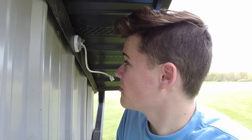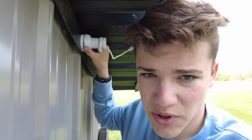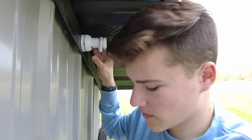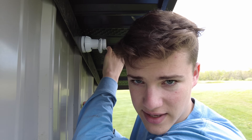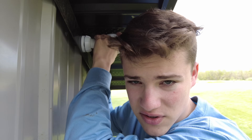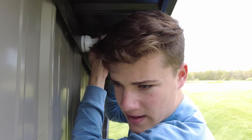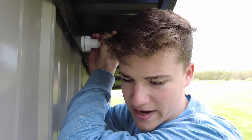These cameras only have two screw holes, so I'm going to make two new screw holes in the barn using the mount. Good news is the mount is up and it's solid — I can't move it. The bad news is the mounting job is probably going to make Ubiquiti never want to sponsor me, but that's a sacrifice I'm willing to make. You just need to put this next piece on — I usually find it's easier to do before you put the camera on. Then you take the cable, plug it into the camera, and the camera screws onto the mount. Screw it on nice and tight, then screw that back to the base plate.